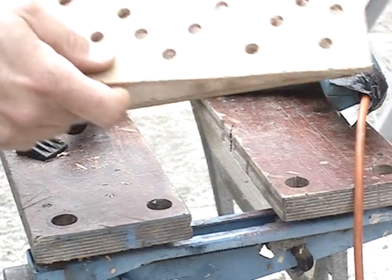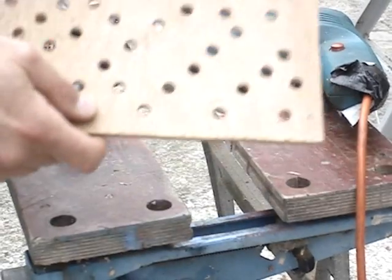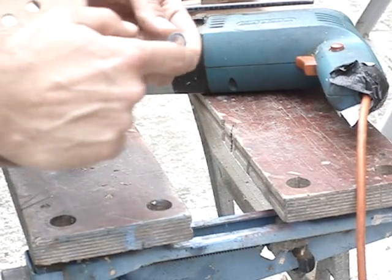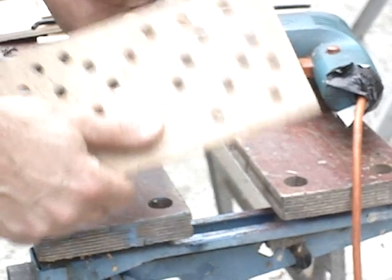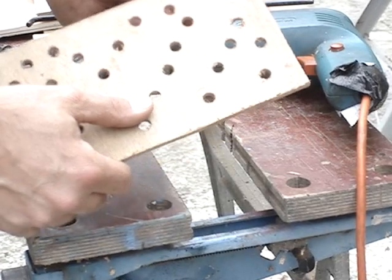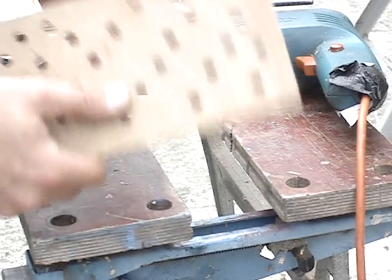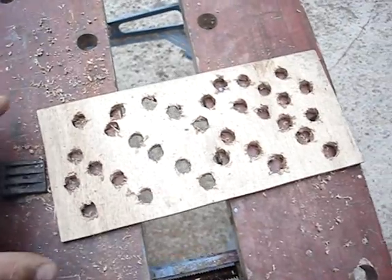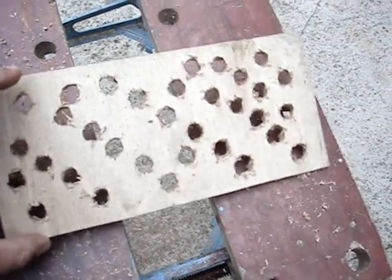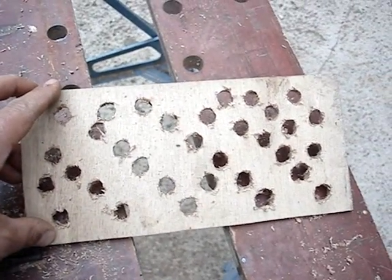The front end — because I drilled them with the same size holes originally — I've got to make it slightly larger, because the tube has a millimetre of plastic thickness, so it's not going to go into a 10mm hole. I've got to take it up to 12mm. There it is: slightly wider holes. It's not very pretty but it will be sanded down, and that will be the pattern of the exit holes.